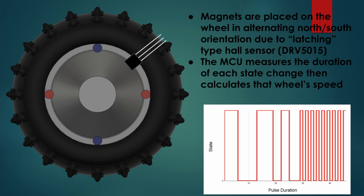Implementing traction control on an RC car is fairly straightforward. I've hot glued four magnets on a single front and rear wheel on one side of the car, and installed a very small digital latching hall sensor on the car suspension facing these magnets. The latching part of the name means the sensor only changes state when the alternating magnetic pole passes by. The four magnets are installed facing north-south, north-south, which outputs a nice square wave signal for the Arduino to read, where each pulse represents one half of the wheel's rotation.